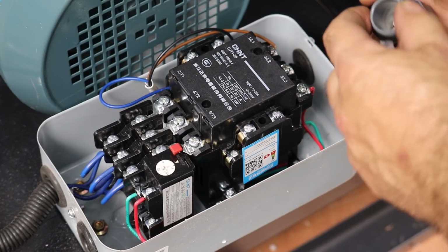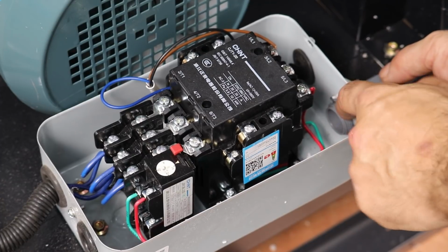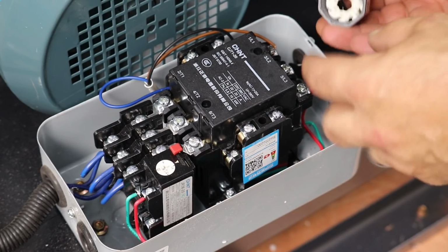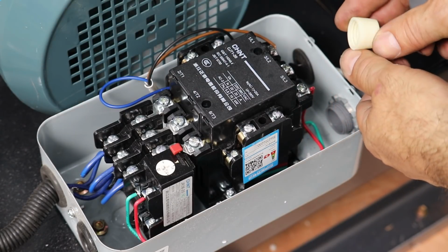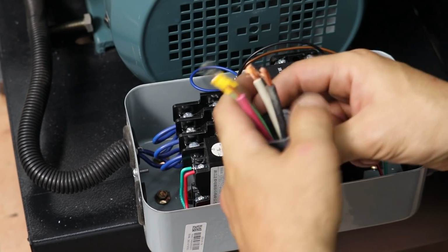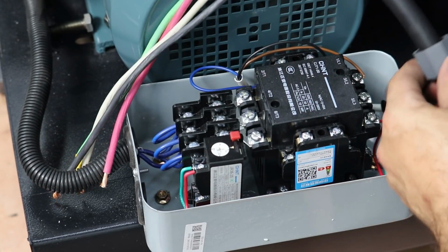So we basically unscrew the crown nut, stick this thing through there, and then we screw on a kind of standard electrical nut here. In fact, I could probably just do that now. And I'll come back and tighten it with the screwdriver later. And then on this end, there's an adjustable ferrule, this plastic ferrule. And then there's like a rubber insert as well, which maybe, no, it's just gripped. So we're gonna stick our power cord through all of this and string the cap and this ferrule on. I don't know how many times I've forgotten to put this cap on first. We're at the upper limit of this cable, but we should be okay.